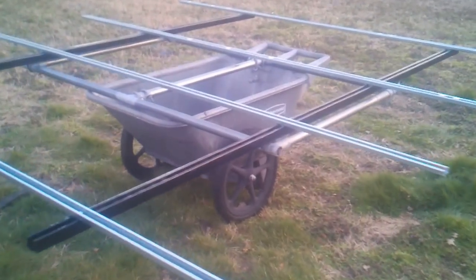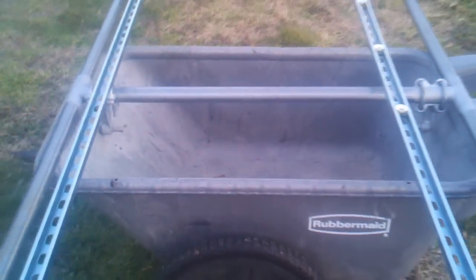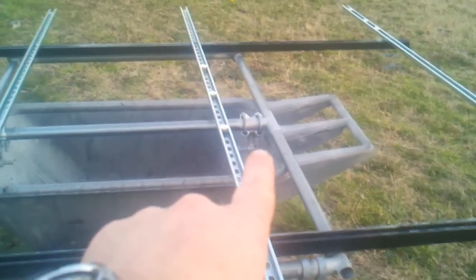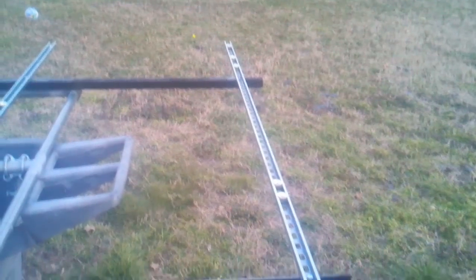This is the beginning of the rack that's going to hold all the solar panels. It'll articulate from this pipe — the center axis — with a couple of brackets mounted on there. Then you've got the outer frame, and I connected the large unistrut or super strut to that with muffler clamps. This is inch-and-three-quarter pipe with inch-and-three-quarter muffler clamps. Those two runs are full 10-foot lengths, and then these are the smaller unistrut in 10-foot lengths running the other direction.